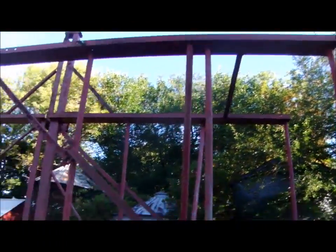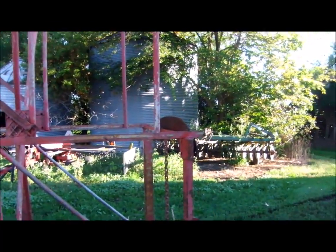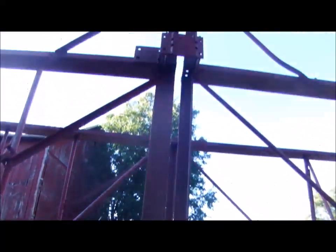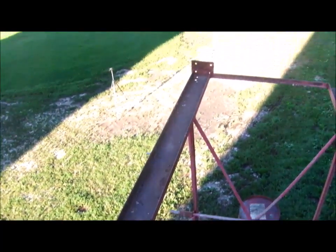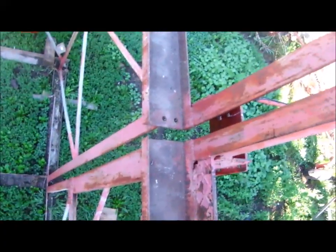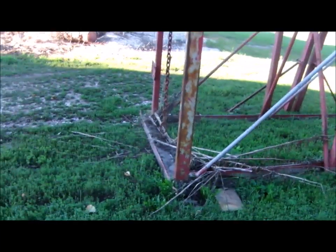This is a floating arm style trebuchet where this track above holds the fulcrum which rides horizontally. The counterweight rides vertically in this track which is just big enough to get a pipe through. As the pipe slides down it pulls the arm assembly across which does the throwing action. Here's a look at the track from above — it's just C channel — and here's the spot where the vertical and horizontal tracks meet so that the wheel can roll over but the pipe can also fit through.